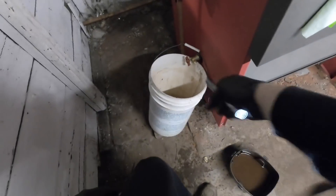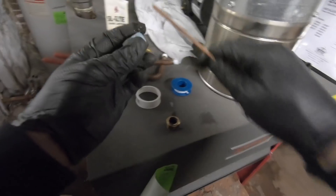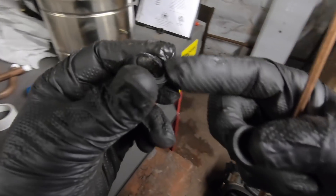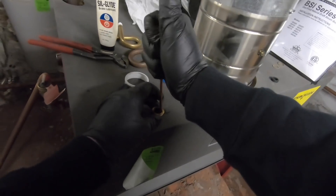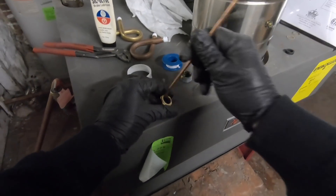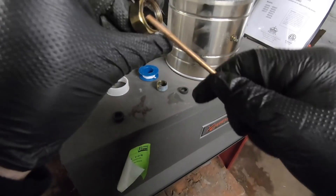I'm going to go dump it. Set a brick underneath that bucket to catch the drip while I rewire everything on this side. These gaskets are going to have to go — they're only a dollar, that's all I charge for them, but I'm not reusing them. This is what they look like new, and this is after being in the boiler — it's indented on both sides and may not make the same seal it once did. I also changed the friction ring — this guy's stuck and he's ripping, so he's got to go.